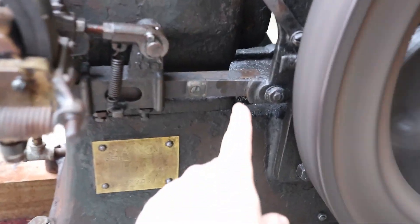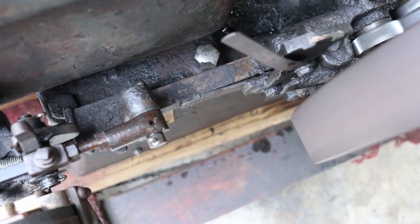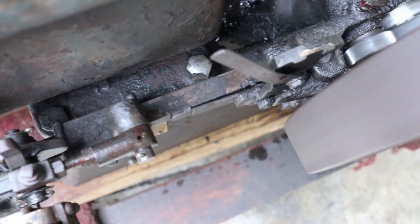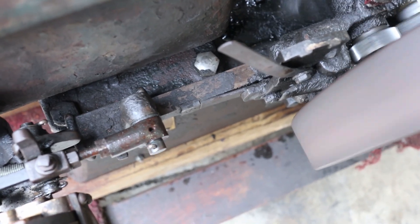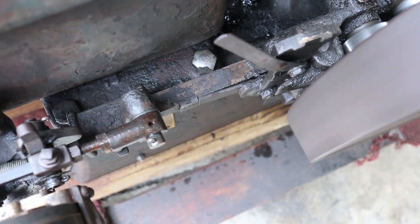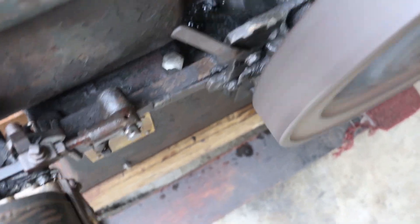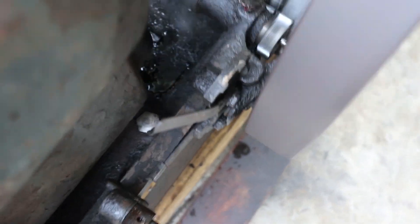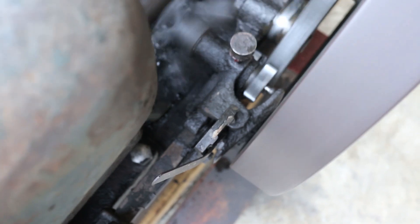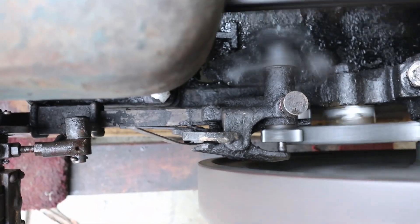There's a little tab here — this is your latch-out bar. If you kind of look from the top, that latch-out bar hooks onto a little piece of metal to hold that pushrod open. And then when that latch-out bar moves away, it allows the pushrod to go back. That latch-out bar is operated by that plunger on the end of that governor.